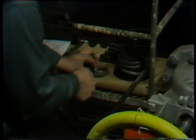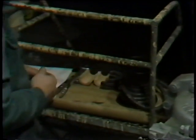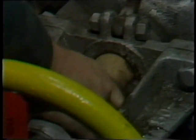The workman continues repeating the steps until all four rings have been cut, then begins to install them in the stuffing box. He takes the first ring, places it around the valve stem, carefully ensures the two ends join flatly together, and pushes the ring into the stuffing box. He then uses a specially fabricated wooden bushing to firmly seat the ring. Each ring should be seated individually before the next ring is installed, to ensure it is fully and squarely inserted.